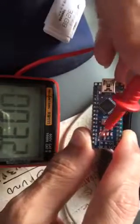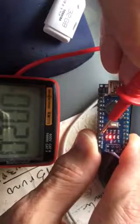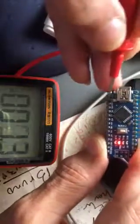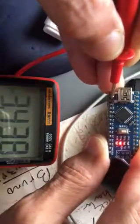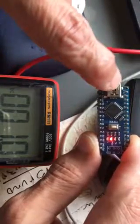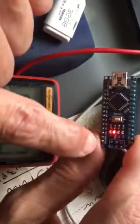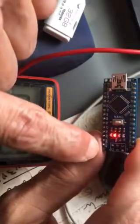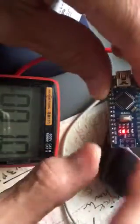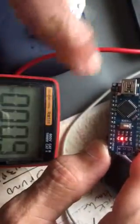I'm checking here — I'm using 9 volts here, checking the meter. I have 5 volts here at this point and 3.3 here. But on the website, people say the 3.3 volts is only when you are using USB as a source, and it's not true. It's true that this only works when you are applying voltage by the voltage-in, and it works independently, but I don't know how it's connected inside. When you apply voltage from up to 12 volts, you can get 5 volts and 3.3 volts.